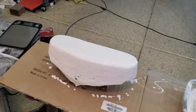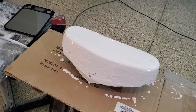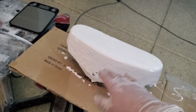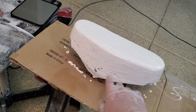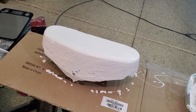Did a coat of gel coat. I think this is both a bad and good thing — it's just not sticking; I put it on and it kind of starts to come off. I think that's good, meaning I think my mold will release. But I want to get a nice solid gel coat layer, so I'm going to do a second layer.